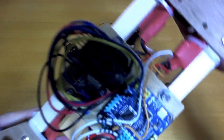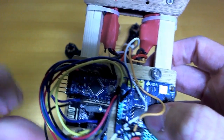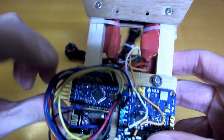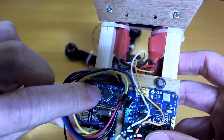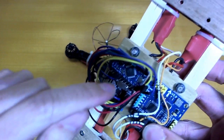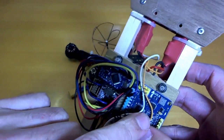As you can see, maybe there's two chips on these things here. This one, there's a big square chip in the middle, that's an ATmega328P chip, and then up there we have exactly the same chip. So there's a little bit of redundancy there, because the Pro Mini over here is not really doing much, because most of the work to process the radio signals that are coming in is actually being done by the RF24 module here. So this Pro Mini is purely there as a go-between between this module and this module.